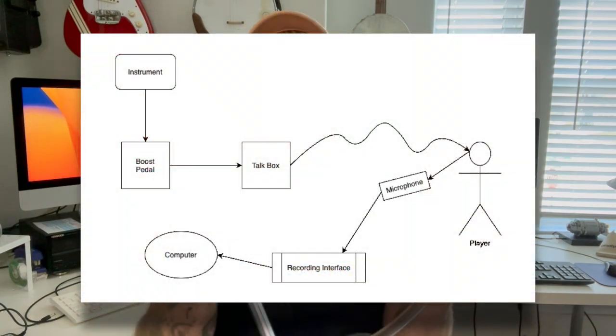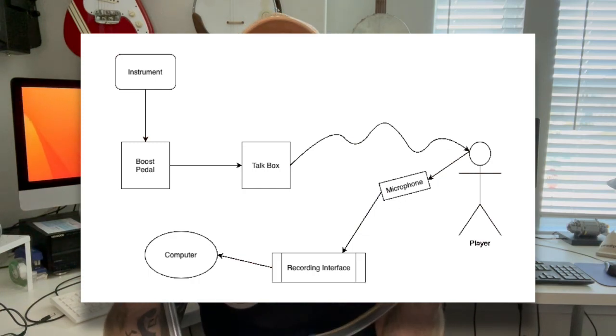Okay folks, there you have it — that's how you make a cigar box talk box. Pretty simple and straightforward: a horn driver, a reducer, some tubing, and a little amp circuit inside. One thing worth mentioning — with the keyboard it worked really well, about the right volume. With the guitar it was really quiet even cranked all the way up. So I put a clean boost between the guitar and the talk box to boost the signal, and I actually dirtied it up a bit for some grit. That's why you heard that grit effect — it worked really well with the boost.